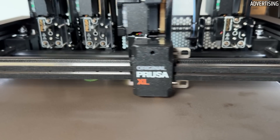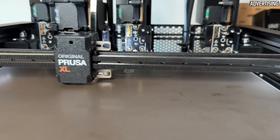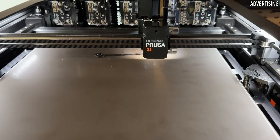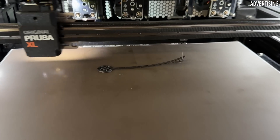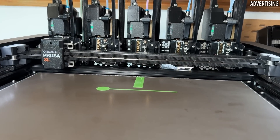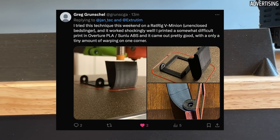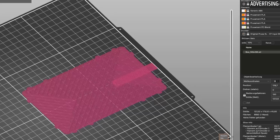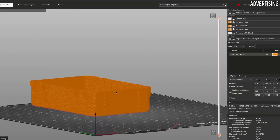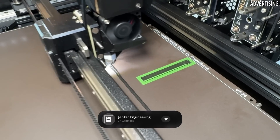To investigate further, I downloaded a warping test from ExtruGym and first printed it completely in ABS as usual — with a 65°C bed, which doesn't work at all, and then regularly with 100°C, which showed relatively strong warping. Then with my trick using a layer of PLA, the warping was very minimal. Over time I tried more variations and also got initial feedback on Twitter. There is still a lot to test and optimize, which is why I'm working on a detailed video about this method. Please subscribe so you don't miss it, and share your ideas in the comments.